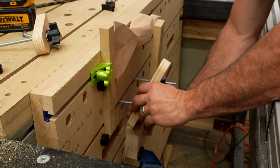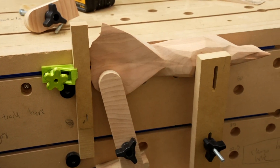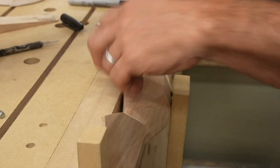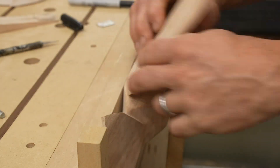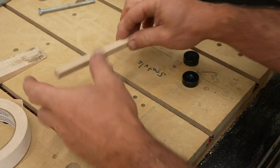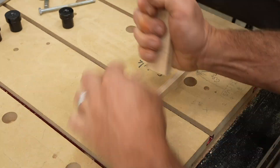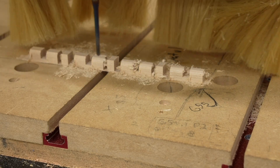I tried the same technique to hold the body together, but that really wasn't working just because of the shape of the body. In the end, I realized it didn't matter too much as long as it was in the right rough location, so I just clamped it down as best I could and went ahead and machined the body too. For those little wing hinge pieces where I made a slot in the wing, I cut out a small piece of maple and used double-sided tape to hold them down onto my CNC table. I milled them out with an eighth-inch down-cut bit for the roughing pass and then an eighth-inch tapered ball nose for the finishing pass.